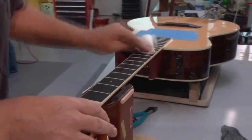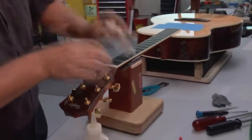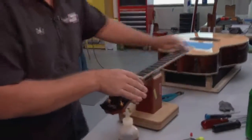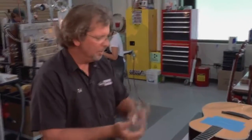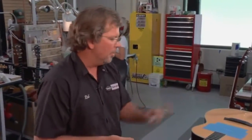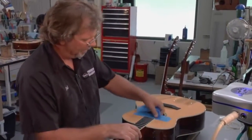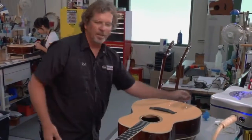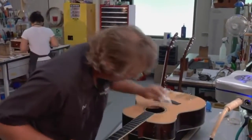You may read directions on the boiled linseed canister that say to leave it on for 12 to 24 hours — no, this is not furniture, it's your guitar. We now have the fingerboard ready to go. It's been polished, cleaned up, and oiled. The guitar is polished and cleaned up. I'm going to remove my tape. Because we waxed it first, it makes it a lot easier if there's any oil residue left on the guitar — we can just come right up and wipe it away.